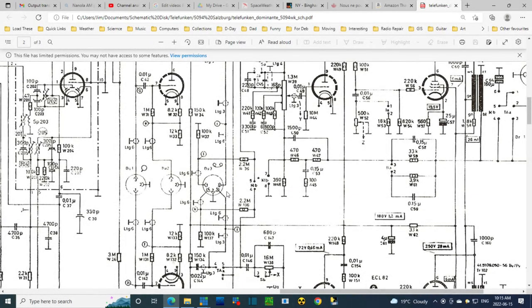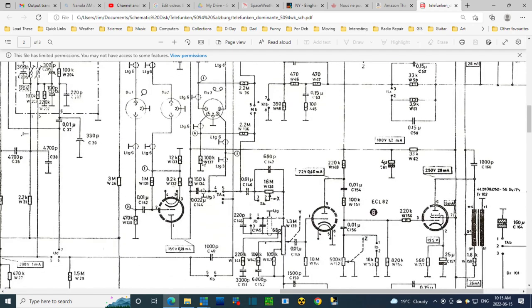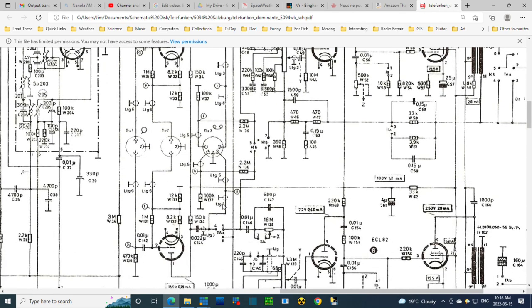Okay, so right now the Bluetooth is connected to this connection and to number 3 here. Both of them have a plate voltage sitting on the other side of a blocking capacitor, and both of them show a charge showing up, indicating these capacitors are leaky. You know, I can just go ahead and assume that every capacitor that has a blocking job to do is probably leaking enough that it's not doing its job right. I suggest changing out all these capacitors again.